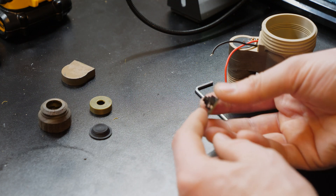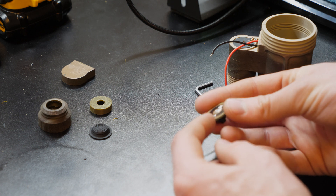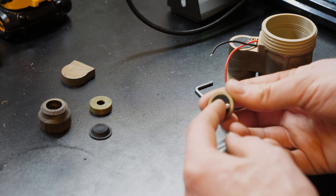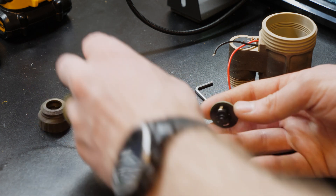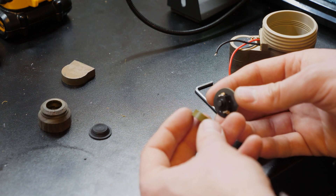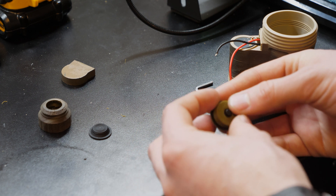So the battery cap — you'll just take the button, solder it onto the board, bend the little tips. I added a little bit of solder right here just to give the positive end of the battery something to touch a little bit more. You can 3D print this little piece right here, it's part of the PVS-69 pack.